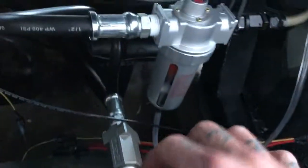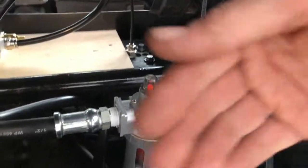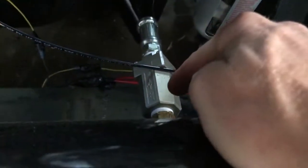I ran half-inch line so that the pressure builds up as fast as possible. Then you have a half-inch check valve, so if anything from here forward breaks, the tank will hold the air in. This check valve will keep it in.